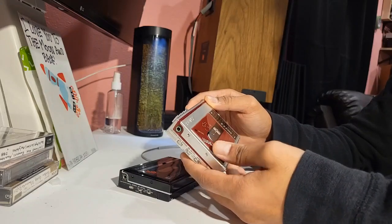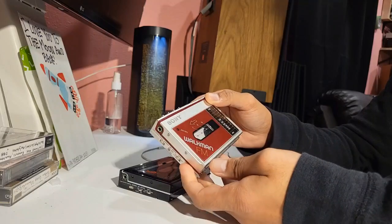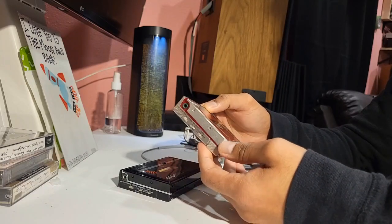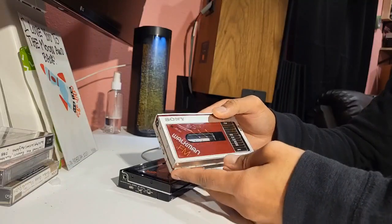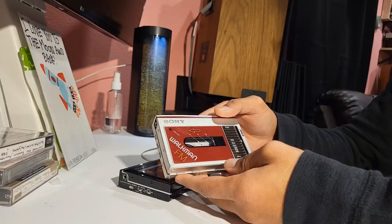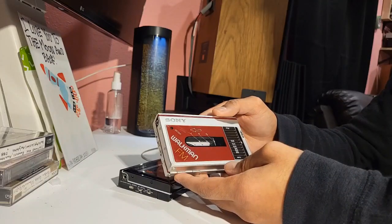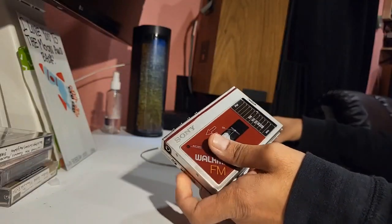So there was an intermittent connection, so it used to work intermittently. I always thought it was because of that corrosion in the battery compartment. But finally it just broke, and it stopped working after I thought I fixed it and put a new belt in it. So I had to go in again and debug, and found that dislodged jumper, and then used a jumper wire to fix that forever, I guess. So now the FM in it works.